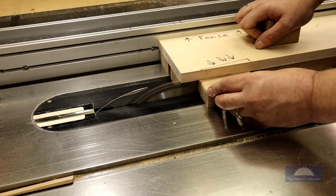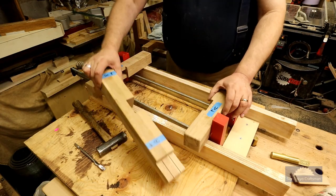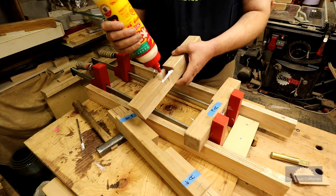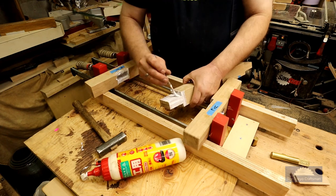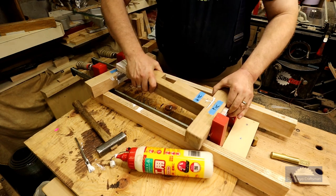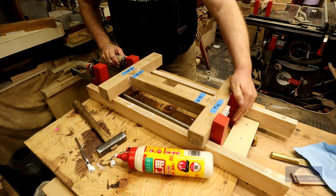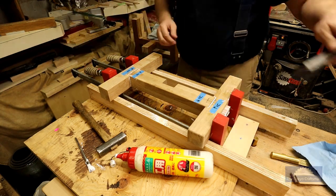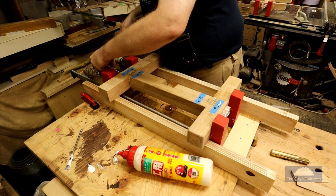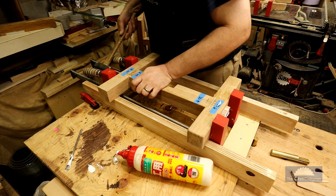Making wedges for the wedge tenons — a simple little jig works really well. Did a dry run; now I'm going to do the glue-up. Regular old wood glue. I put a bit too much glue on but that's okay, it wipes off — too much is better than too little. I marked them well so I couldn't put it together backwards. Now clamp it up, wipe off the excess glue, clamp it up, and bang in the wedges. Check for square, put glue on the wedges and tapity tap tap. Those wedges are never moving; the tenons aren't going anywhere either.